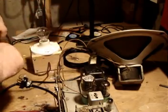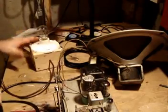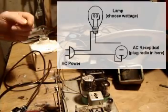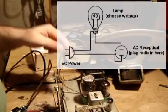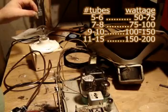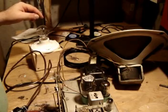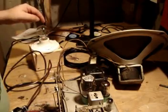The way that I do that is with this little gizmo I've built — as you can see, it's just a light bulb. But the way I've wired it, I've got it plugged into the wall, and the light bulb is actually wired in series with the power supply to this chassis. So if the chassis is drawing the amount of power it's designed to draw — about 60 watts — this light bulb should not burn, or if it does it will be just a faint glow. If the chassis has a short and draws far more power than it should, this bulb is going to glow brightly, limiting the power draw to about 60 watts and protecting the circuit.